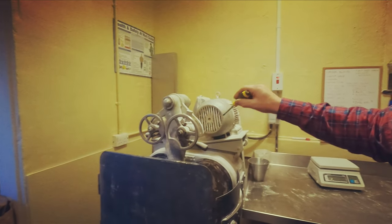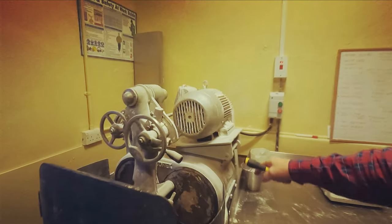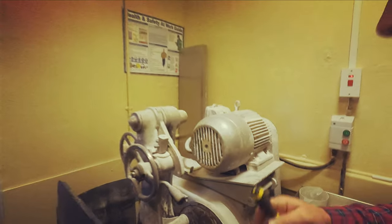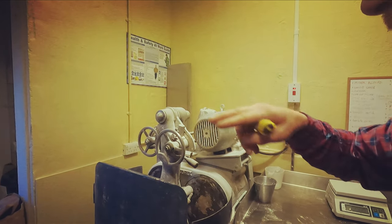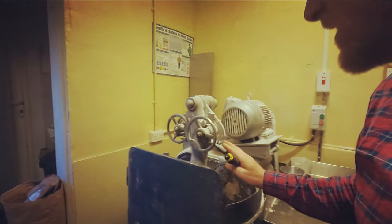That's why I've never got enough time to do the actual maintenance that's required. This mixer here needs an overhaul — it has a clunking noise, there's play in the shaft in the main shaft here. It knocks back and forward and eventually it's going to smash the gears. It needs overhauling, and could do with a paint. The oven's another project for the future — basically it hasn't got the steam capacity, so I can't inject steam into the oven.